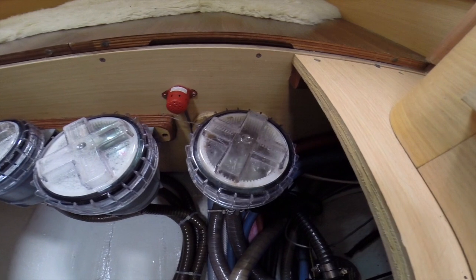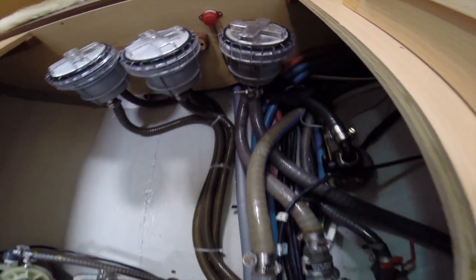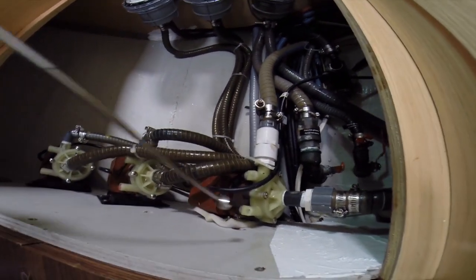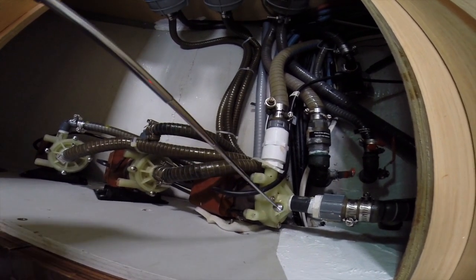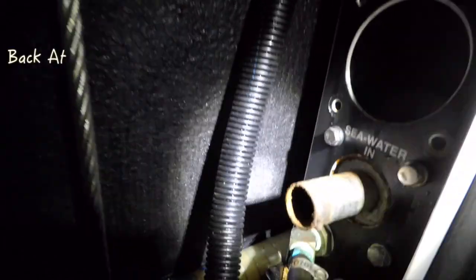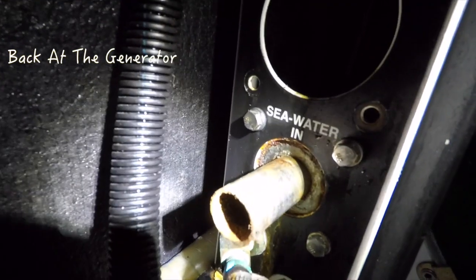And there we go. Now the water is running. As you can see, that water is running, and that is this pump now that is turning here. The other nice thing is that there's no impeller in here that is attached to a shaft. This is actually a magnetic impeller. So in the years that we've been running it, we've never once lost an impeller on these March pumps. They're fantastic. I'm going to get rid of this one as well. I'm going to pull this one out.